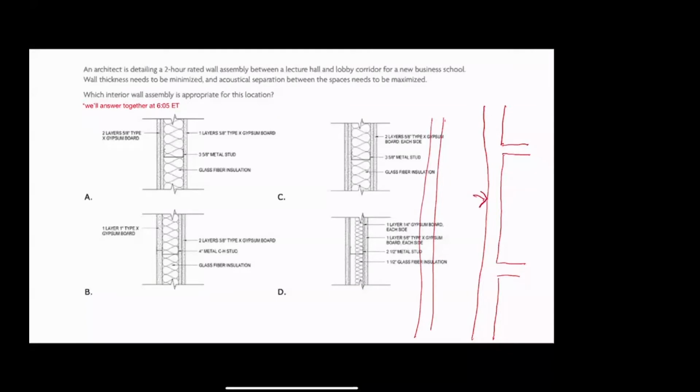Instead, what we'd like to do is stand right here, and attach the drywall to this face that we need for fire protection. And we'd also like to then attach it to this face like we normally would. And that's what you were watching. And those 1-inch thick panels are called liner panels. And they're what's used for a shaft wall. And so that's what this is right here.